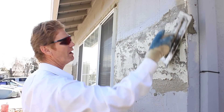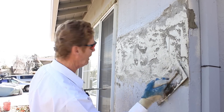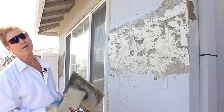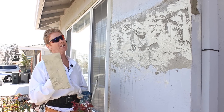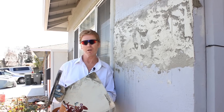Once you've got your skip trowel on it, look at what they've got and match it — just like that. Guys, if you're going to pull off a belly band, the most important thing is how you're going to watertight that area. If you mess up on the texture that's not a big deal, but if it leaks, that is a big deal. My name is Kirk, with Kirk Giordano Plastering. My son Jason is on the camera as usual — we thank you for watching and will see you on the next fix.